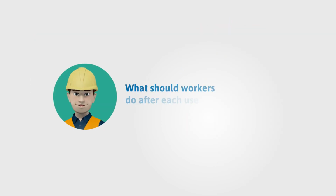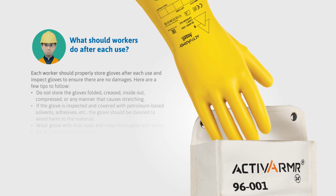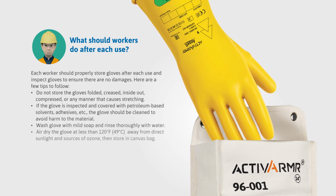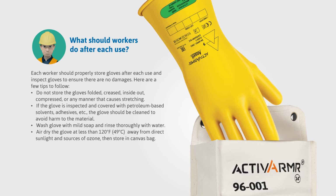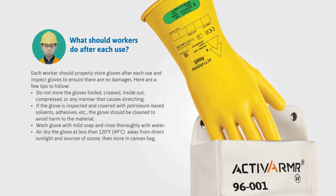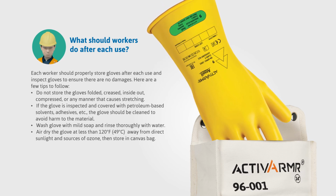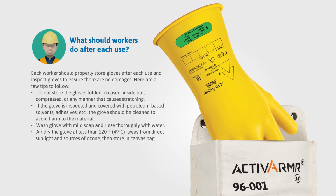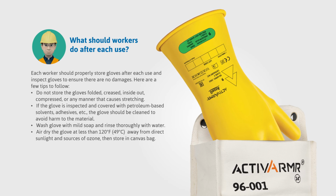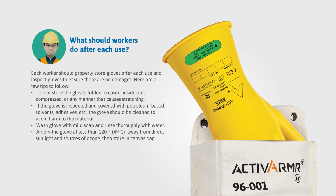What should workers do after each use? Proper storage is necessary to ensure no damage to the glove. Gloves should be stored in an ActivArmr canvas bag to avoid excess sunlight or sources of ozone that may damage the glove. When storing, do not fold, crease, turn inside out, compress, or stretch the gloves in any form. If the glove is inspected and still contains residues, the glove should be cleaned to avoid further damage. Wash with soap and rinse thoroughly with water. Be sure to air dry the glove at less than 120 degrees Fahrenheit before storing them in a canvas bag.